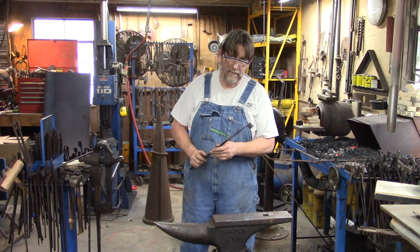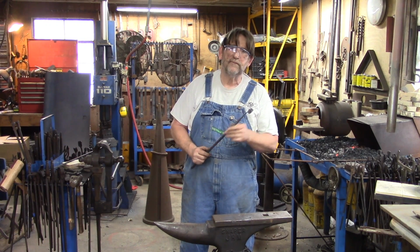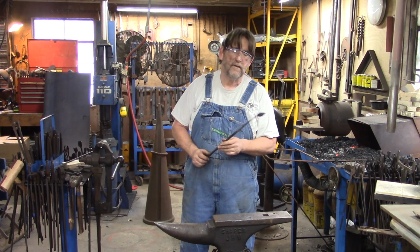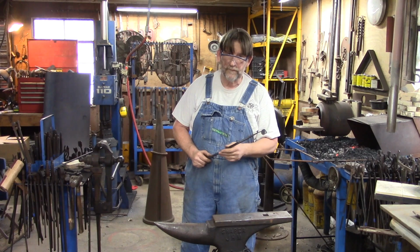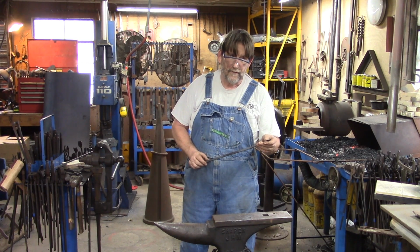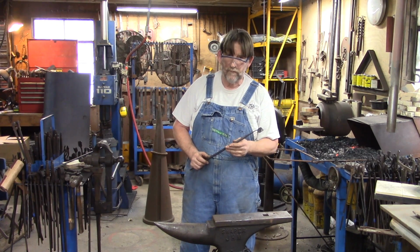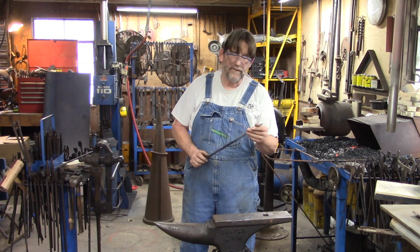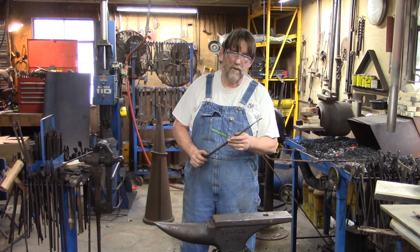I make them out of 3/8, half inch. I've made them out of 3/4. For the basic leaf, 3/8 is a good size to start with. When you get to the folded leaf in the next video that we're going to do later on today, I like making them out of 3/8 and half. Half is probably a little easier because it holds heat longer. But for the basic leaf, I like 3/8. It's not too heavy to work with, and it works well for me.